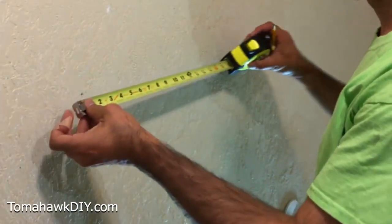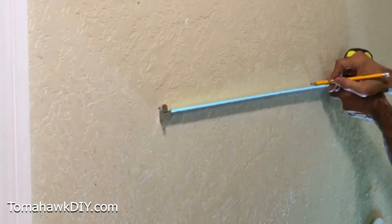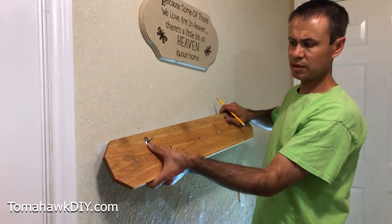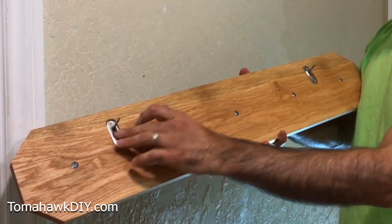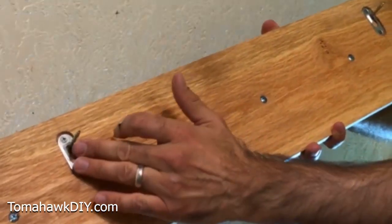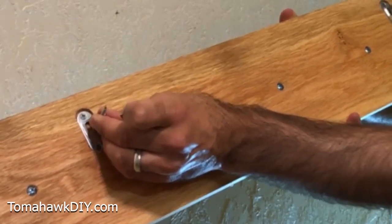Measuring the back of the coat hook, I found that the hardware is 18 inches apart. So my second point is going to be right about here, but I'm going to show you a little trick to make it easier. On this kind of hardware to hang your coat hook, you don't have much forgiveness. You've got to be right on with the screws because you put the screws on the wall first, and if the screws are not quite right, you're going to end up off a little bit and it's not going to hang.